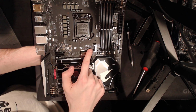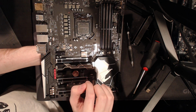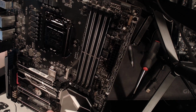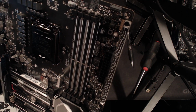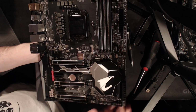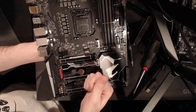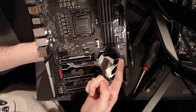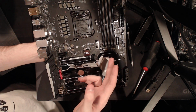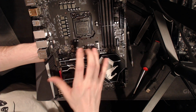Now, above the Turbo B clock, you actually have three low dropout regulators. These are 3 amps each. They're from Richtek, and they are RT9018s. The reason these are on the board is basically for VCCPLL-OC, and I think VCCPLL and VCCDMI, I want to say. Basically, these exist to supply the extreme overclocking voltages.